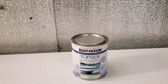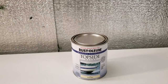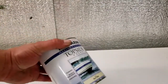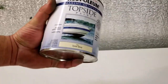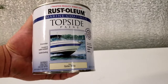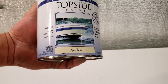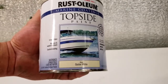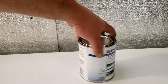We've made a paint selection — Rust-Oleum Marine Coatings. Yes, Rust-Oleum does have a marine product line. Topside paint. We have a little lady painted in this and it's held up well. We're working on a commercial boat here — nice, but not a luxury liner. It's oyster white, which is kind of like almost a canvas color — not really white, more like a light tan. We got ourselves a whole bunch of quarts of this and we're going to use it on the Ambrose, so it'll pretty much match the little lady. We find it extremely durable, easy to apply, and it doesn't break the bank.